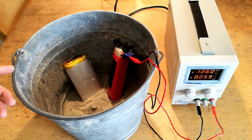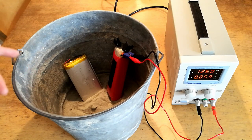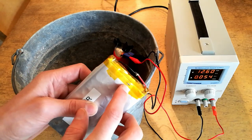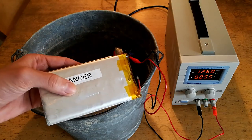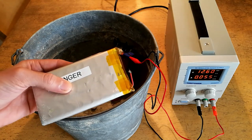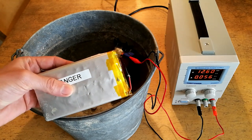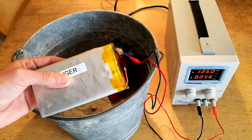You may also want to fully discharge batteries even if you are going to take them to the battery recycling center, particularly if they are damaged. For example, this battery was given to me by a friend to dispose of properly and it's actually been punctured. You can tell that a lithium polymer or lithium ion battery has been punctured if you can smell a bubble gum or banana-like vapor coming from any part of the cell. If that is the case, the battery needs to be treated as extremely dangerous, not only because this gas is quite flammable, but also because oxygen is entering the battery, which can also make it unstable.